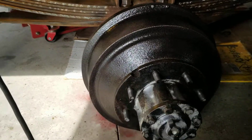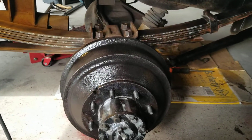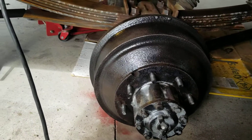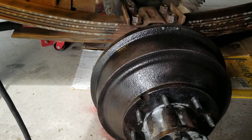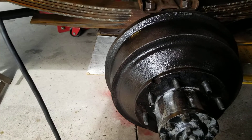I sprayed this handy-dandy Loctite Xtend Rust Neutralizer that I bought a while back. I'm testing it out — it's turning black. The instructions say it turns black and neutralizes the rust. I'll probably grab some more and throw it on here before I paint it. You have to put a paint coat — they refer to it as a top coat — but you've got to wait 24 hours.